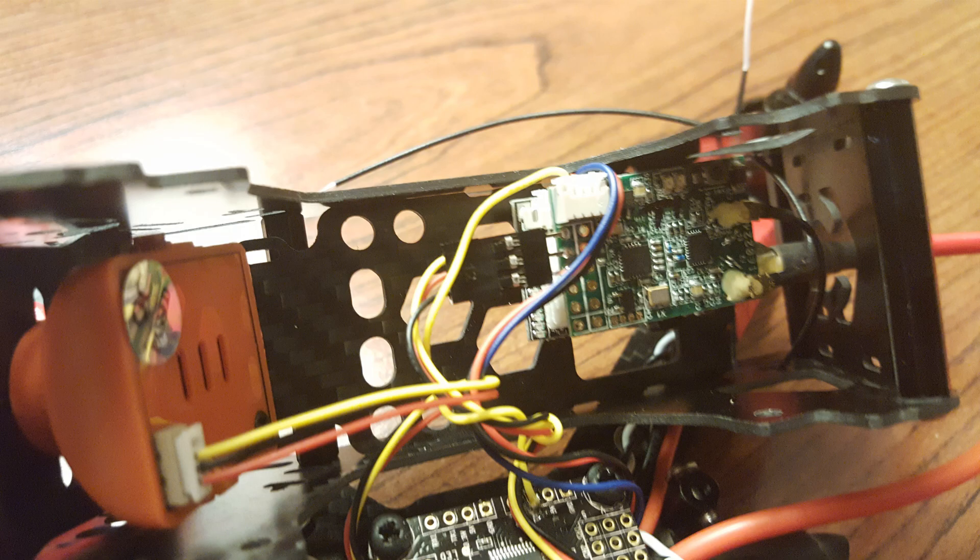I've stacked the X4R receiver and the video transmitter to each other, though I didn't actually end up going this way because I just didn't like how it worked out. If you de-pin your X4R, it will fit on the top plate with a typical TS5823-size transmitter. If you do not de-pin it, you'll need to have the pins face down or at an angle to get them both to fit.